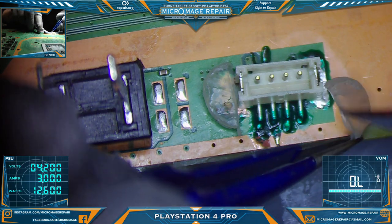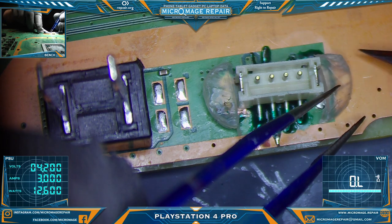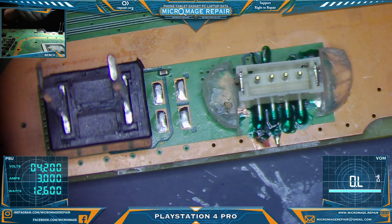And I was wrong on all my temperatures and airflow, because I am definitely going to turn down the temperature and airflow drastically. So let's see, I want to go down to like 150 degrees. See, we do not need to be hot at all for the hot snot. We definitely don't need to be in a range to melt plastic. And then we're going to turn down the air to about, let's go 20%.